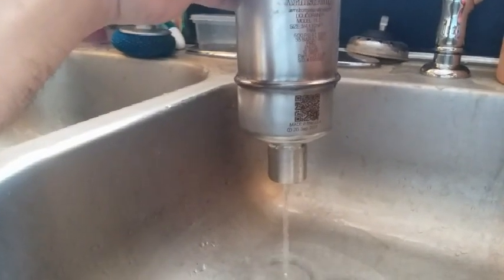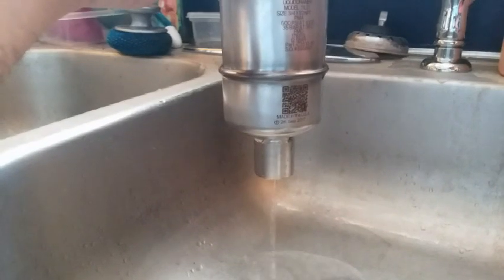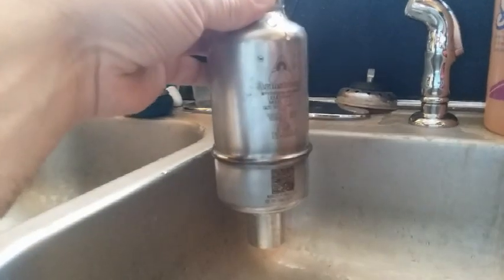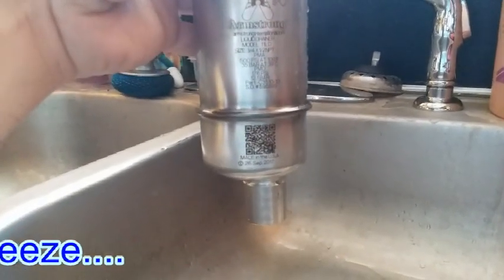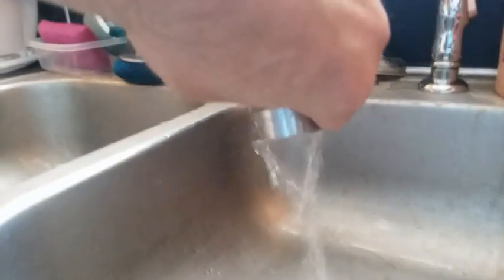Let's let it fill all the way up. It lifted the ball inside, allowing the liquid to drain out. But once the liquid drains out to a certain point it stops — and we still have water in there. It's a water dead leg, or wet leg — whatever you want to call it. It will not let any gases suck back up through here. We have a water wet leg in there, so cool.